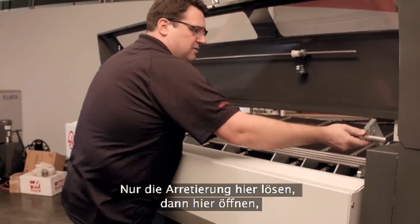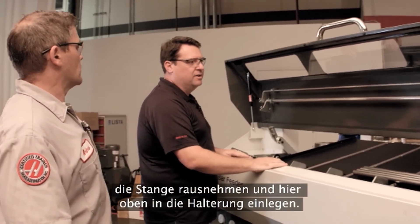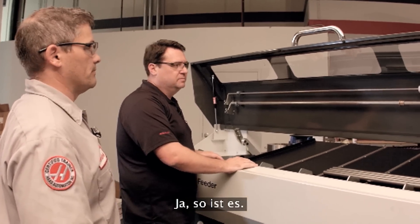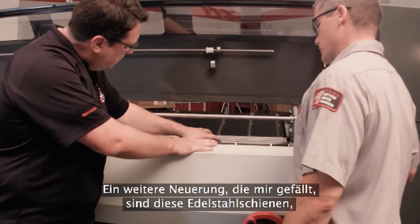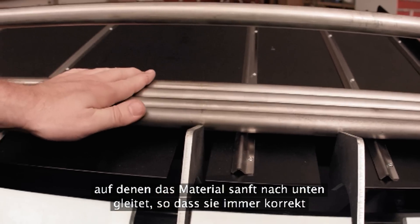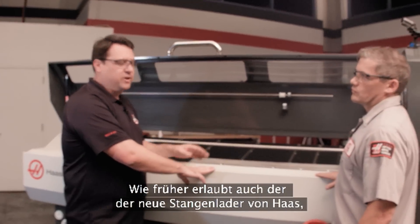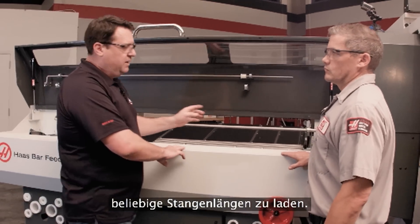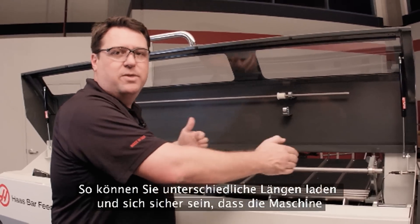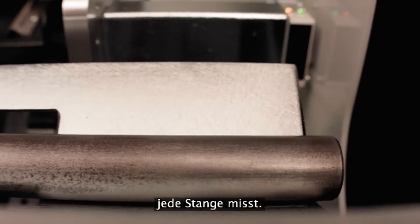Slide over here, the whole piece comes out, and having the storage tray right up here — fast, easy, quick. Get that machine back making chips as fast as we can. Another feature I really like are these stainless steel rails that allow the material to slide down nice and easy and ensure we always get a pickup and transfer. One of the things we can still do with this Haas bar feeder is load random length bars, because with this optical sensor that measures each bar that comes by, you can load in random lengths knowing that the machine will measure the bar as it goes in. Let's go take a look at the interface.